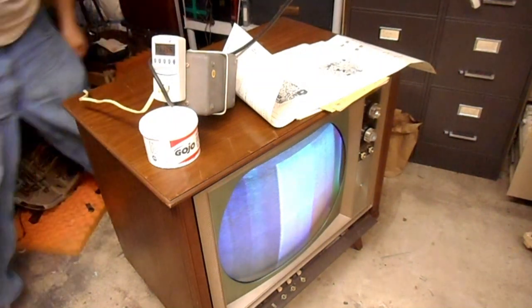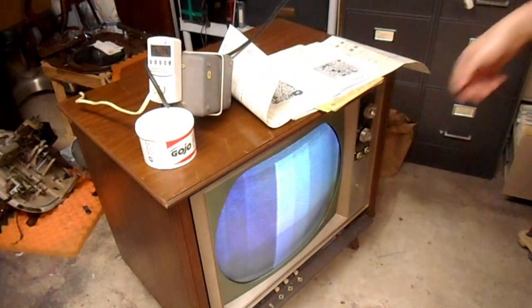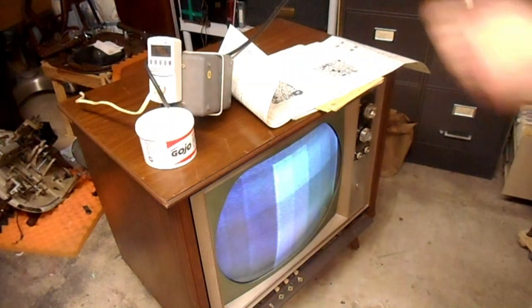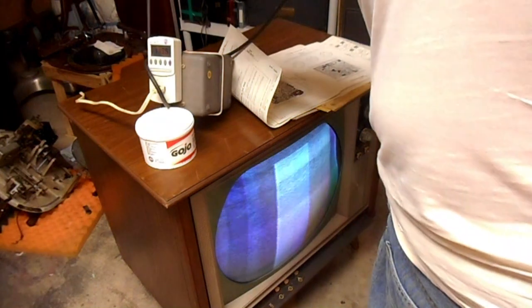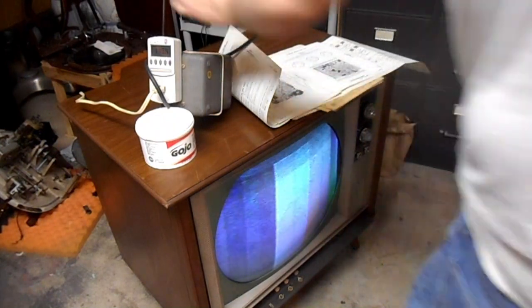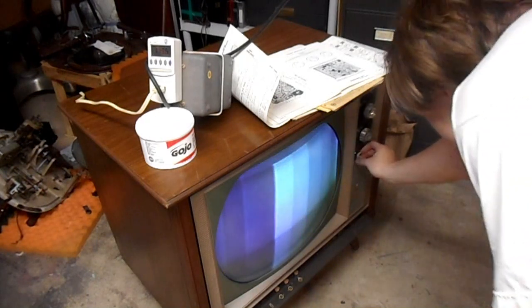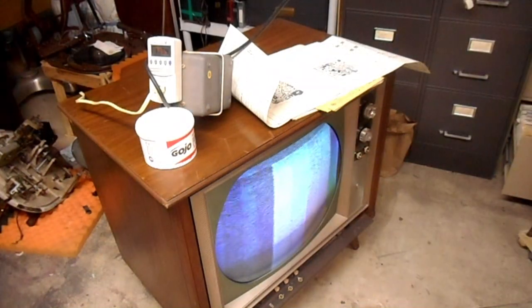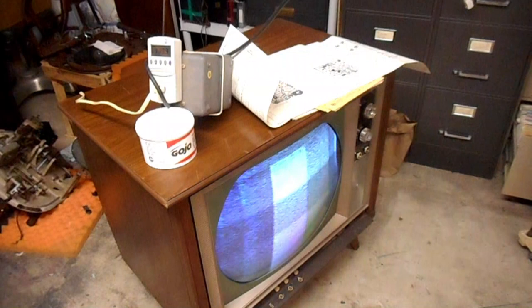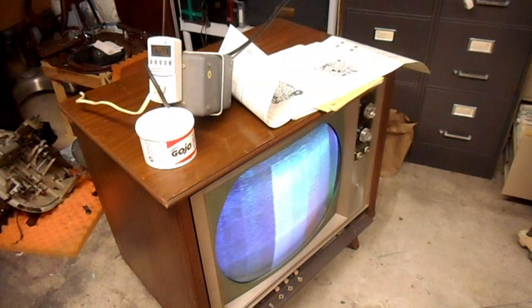That sure looks like color bars to me. That's superlatively stable. Fine tuning's out to lunch, which is making even getting color signal in strongly difficult. The hue adjustment is also out to lunch. It's time I start actually trying to make the B-plus not have hum in it, because this is just completely unacceptable.